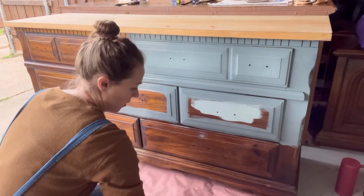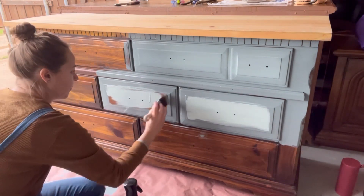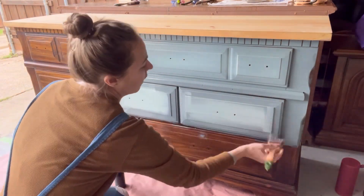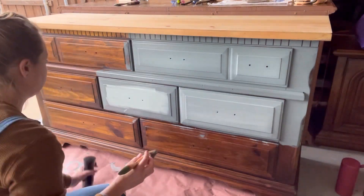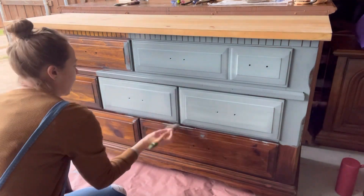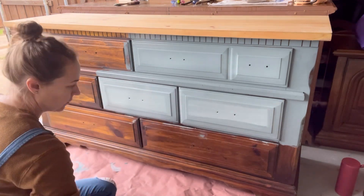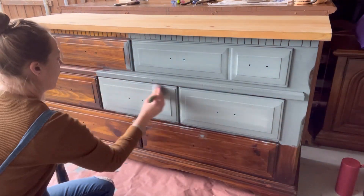I spray the brush with the mister and apply the Vintage Duck Egg. You can also spray the actual drawer with the mister to keep the paint wet, because that helps it blend together better. I mist it, then blend with my clean blending brush — going in a rectangular motion along the lines of the paint, then up and down, then horizontal. I'm adding more Stormy Seas because I didn't like how light it was once blended. I'll just keep blending to get it where I like it — that's why I keep stepping back to look at it.